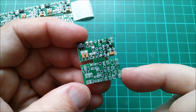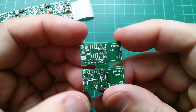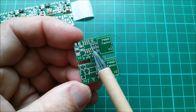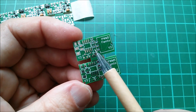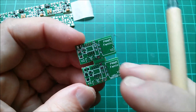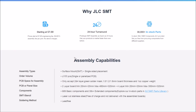Something else to mention: this is a single-sided assembly service, so I requested that the parts were fitted on the bottom side. On the top side you can see this is my PWM5 Femto Version 2 — there are no components fitted here. I can fit those components; there aren't many — I think there are six surface mount components, one of which is the microcontroller. Since this board doesn't offer in-circuit programming, I'm going to have to program the microcontroller before I solder it on.